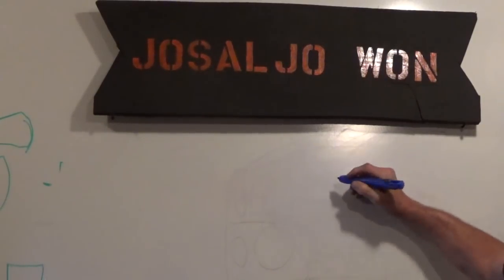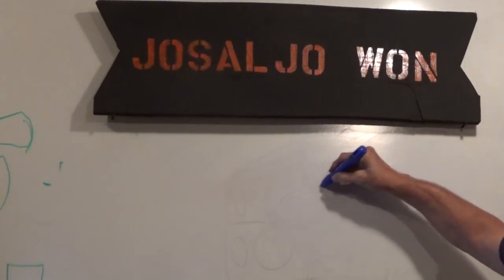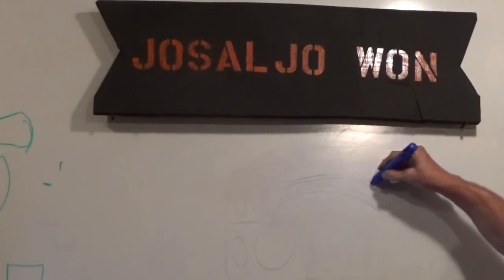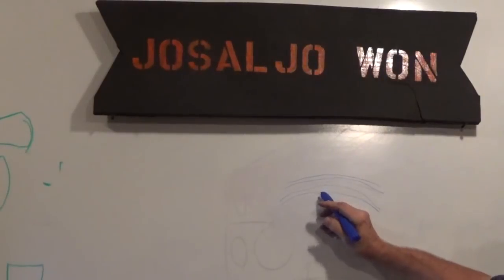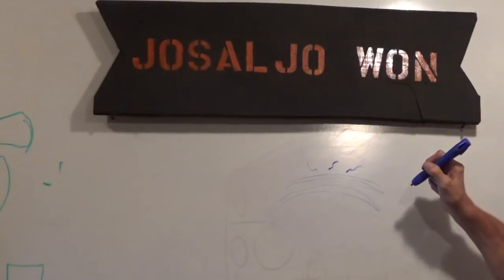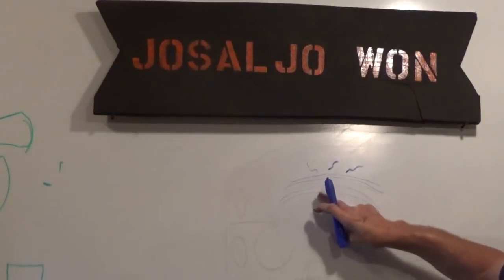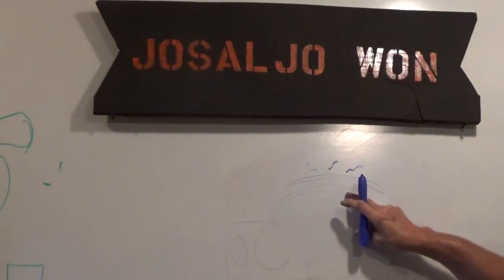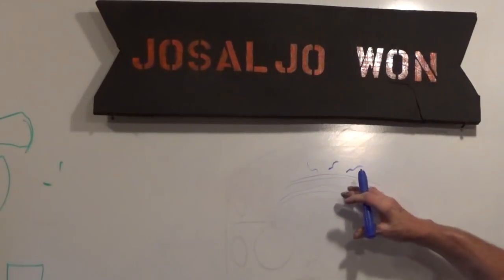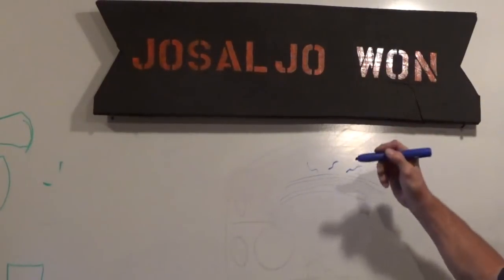You guys who are maybe painters, a painter should know this. If you put a coat of paint on something, another coat, another coat, and you don't let the coats underneath dry, the top coat will get cracks in the surface of the paint. The reason is that the bottom is swollen because there's still moisture in it, or solvents, for instance. And as the solvents come out and the paint adheres to the car, or whatever you're painting, the top surface will crack because it dried previously.